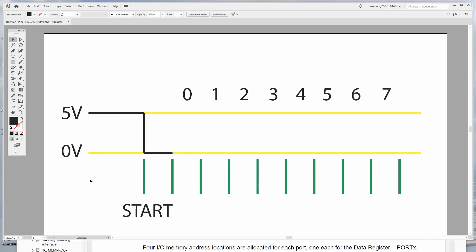Let's talk about the data format for RS-232 style communications. We have two logic levels: high and low, 5V to 0V. In the old days of RS-232 this was actually +12V/-12V, but this is the modern TTL version. You always have a start bit to begin — a transition from the 5V level to the 0V level — that tells the system a byte is coming. Then the next 8 pulses are the bits, starting from LSB. High is the default state the system waits in, so you need a low start bit to signal that a byte of data is coming.